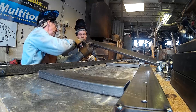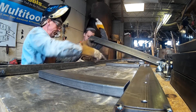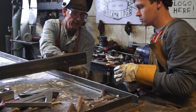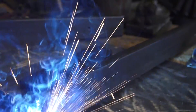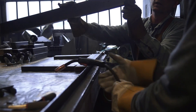That looks real good. The idea here is you get all four corners so you keep that piece from moving. We'll do the same thing down here in a minute. Now let's go and weld these off — this is just a continuous weld right down the side, allowing the pool to form, working the molten metal between the two pieces in a continuous looping motion. That looks pretty good, Alex.